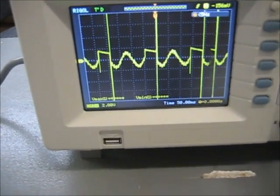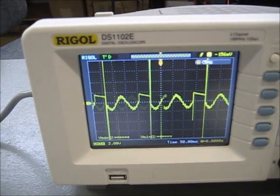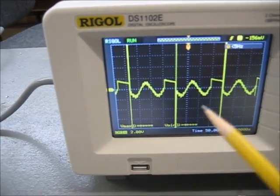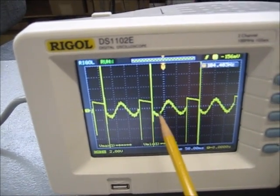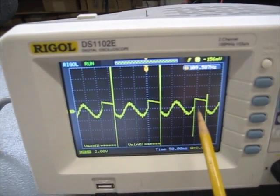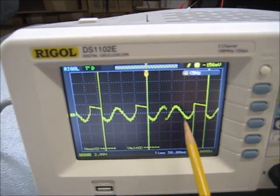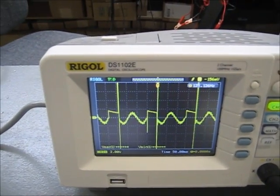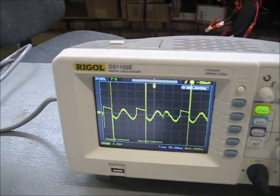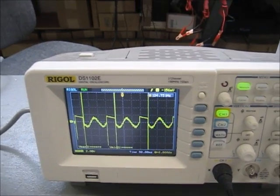Anyway, that's the wave shape coming from this big 8-inch over here. And so you can see the voltage spikes are about 5 times the battery voltage. And you can see it switching on and generating the AC wave in between. So this type of motor might work very well with Dad Halves' 2-transistor circuit, if you can get the bias correctly on his circuit, which seems to be a little work to do.